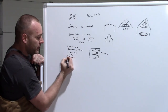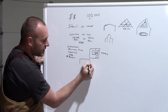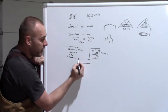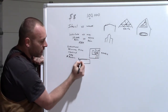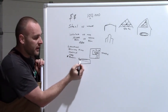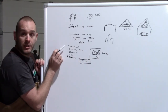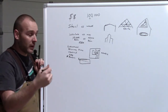Plumbing is the big one, okay? The reason is, you can imagine, let's say this is flat ground. If you have a pipe coming from a sink here in your garage, and where's it gonna go? You wanna get it to your house, right? This pipe can't be flat because the water will never flow. So you need slope to it. You want it to be down like this. Exaggerated, but you need that slope. So, depending on how much of slope you need and how far you have to go, that also helps you decide the location. Can I put plumbing out there and get rid of it back to the house or whatever?